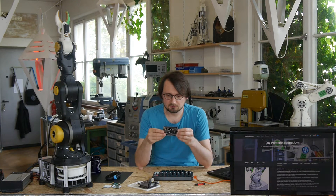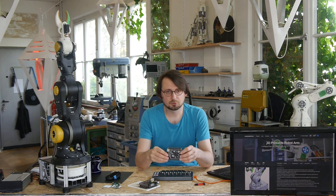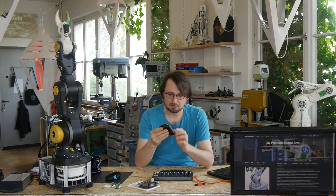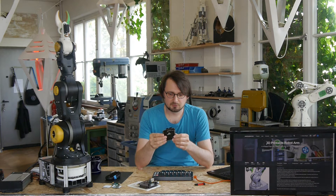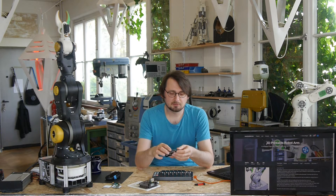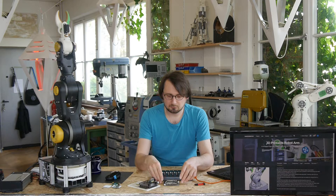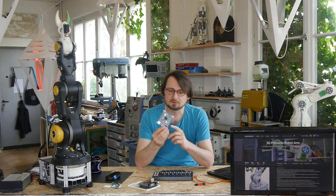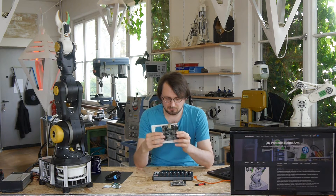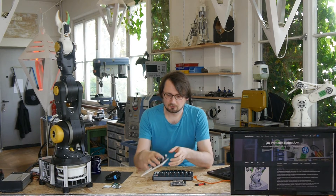For the completely new electronics, I moved from the Arduino Due which I used in the last one to STM32F407 microcontrollers. They run at 168 MHz, they have a floating point unit, and this dev board is incredibly cheap — it's about 9€. I designed my own breakout shield to connect to the stepper drivers, and it also has Ethernet and basically just connectors.